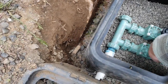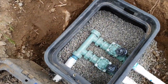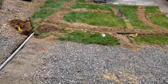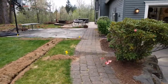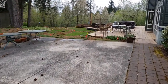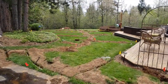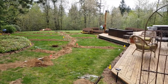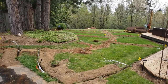You can turn it a quarter turn, and it opens up the valve. And then the water starts flushing. So you want to get all the dirt, little pebbles, and shavings from cutting the pipe, so all the heads will flush themselves, and it gets you ready to put all the heads on, which is what I'm setting up to do right now.